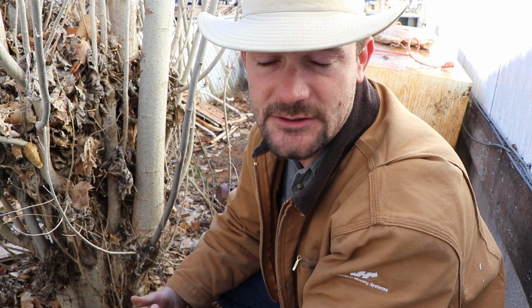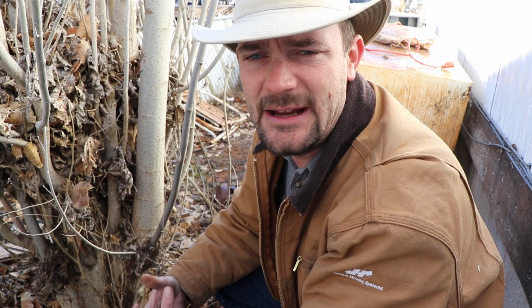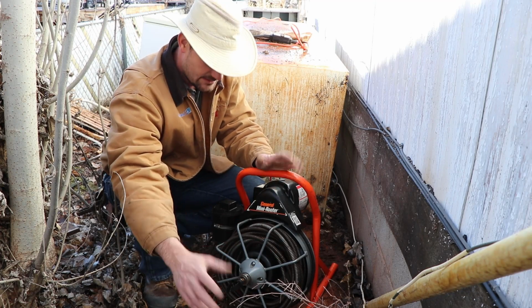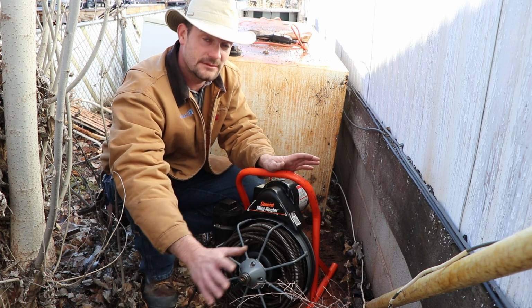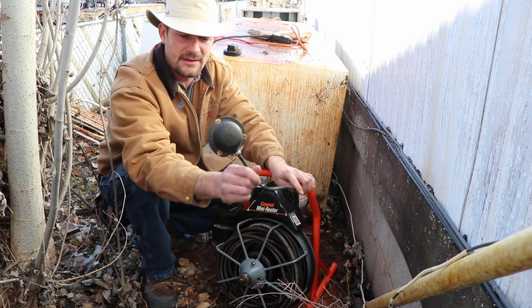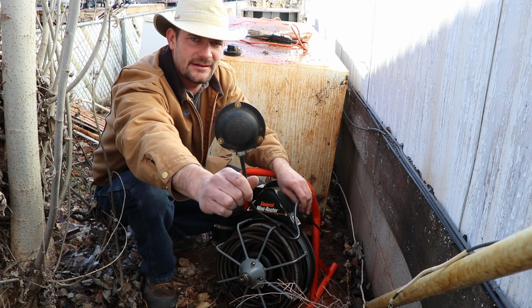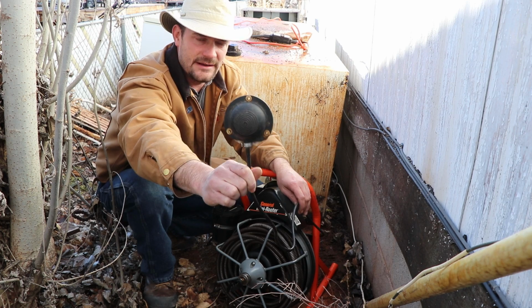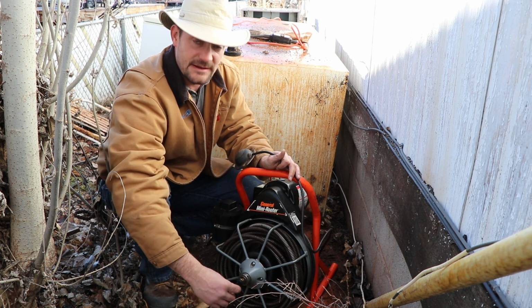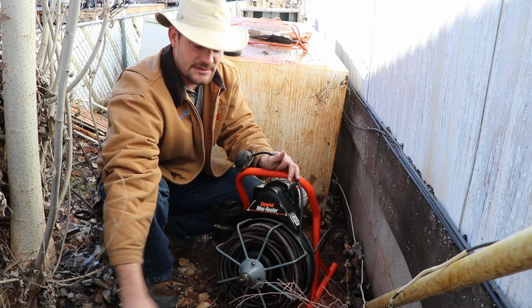The tool that you've rented is electrical powered, so you're going to have to find an extension cord that'll reach to wherever the clean out you found is, and plug in your machinery. Once it's plugged in, check out your basic layout. There's a little foot pedal that looks something like this, and by stepping on it, it spins this drum here, spinning this blade down inside your pipe.